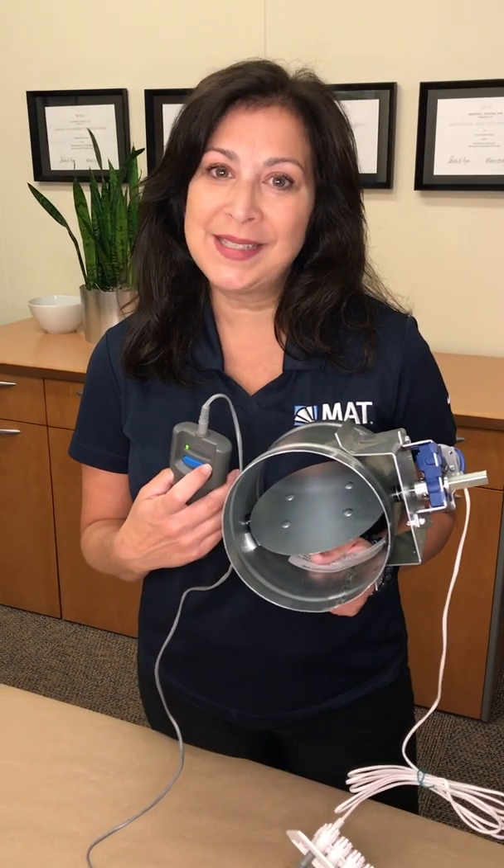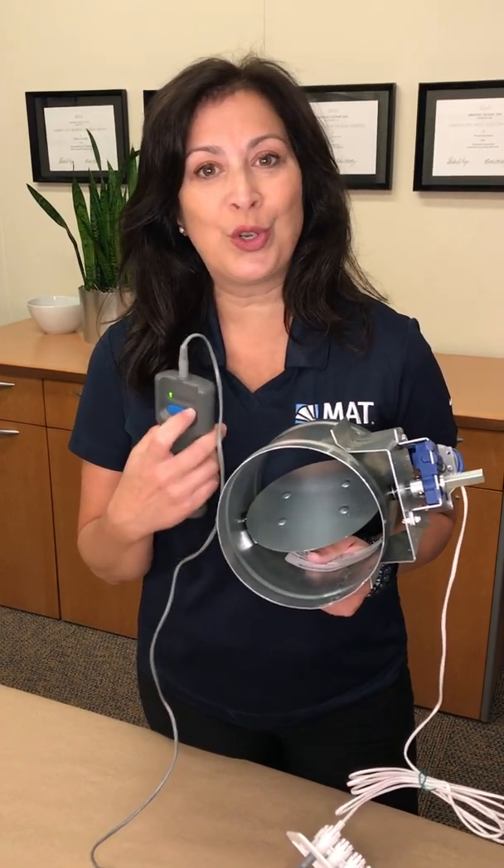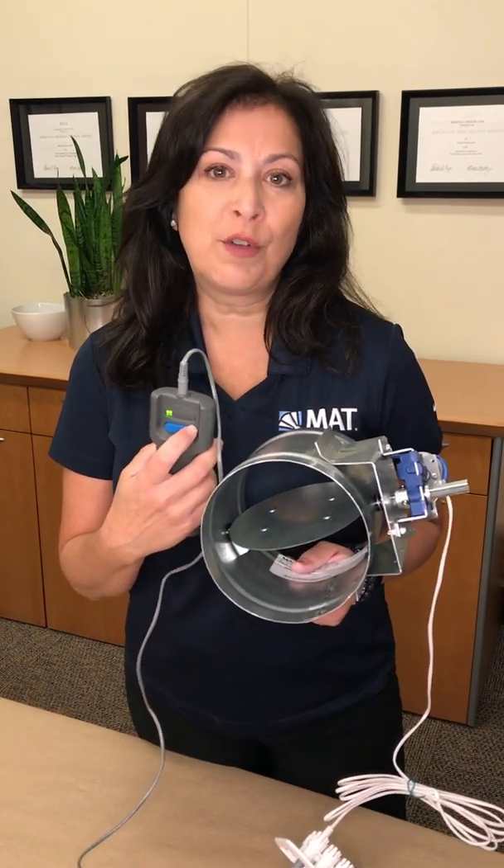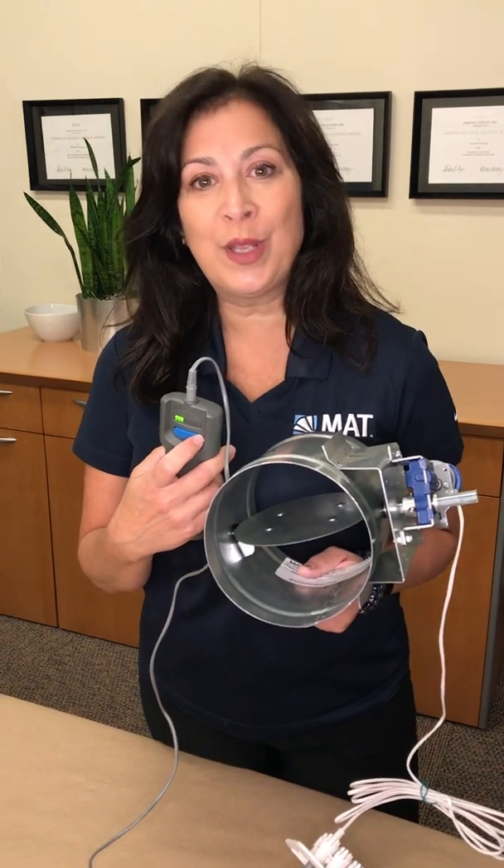When it comes to balancing, it's simple. Your technician takes the remote control, plugs it into the wall unit, and presses the toggle buttons. Each bar on the remote control represents a 10% open/closed position of your damper. We've also added a nice feature: if there's a disconnect, the remote control will indicate that something is wrong — simply tighten up your connections and you're ready to go again. With the Electro Balance, there are no limitations on the length of wire you can run — up to 1,000 feet. It is a plug-and-play system that offers extension wires and allows you to plug and play as you go.